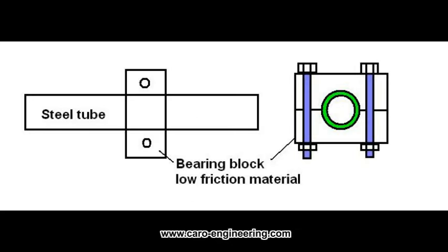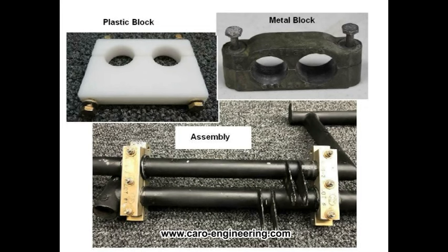Another special case of a simple bearing is used with large diameter pivots like steel tubing. This works because the bearing stress is really low due to the large diameter and wide clamp. The advantage is that the bearings can be bolted together from two pieces, which is often used on parts that have fittings welded on both ends, and it is not possible to slide a bearing on.